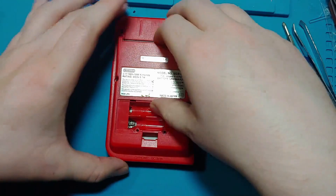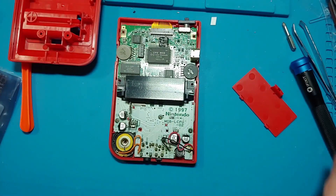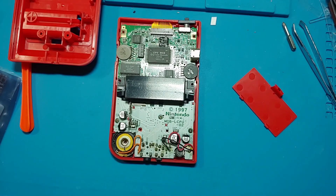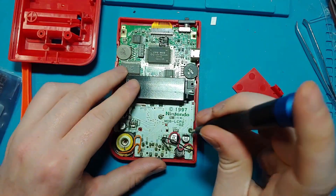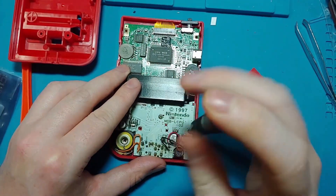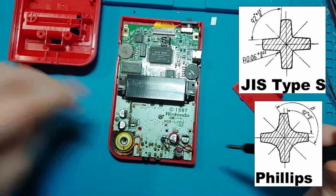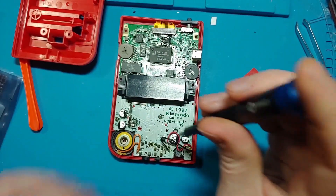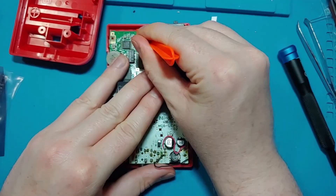This is just a proof of concept at this point. So we're going to open that up — you can see we got three screws here on the inside. Looks like in my infinite wisdom I might have stripped one of these screws. That's why it's important to use JIS and not Phillips head when you're trying to unscrew these. That's the big importance of having a proper screwdriver set. All right, we're going to undo our screen.